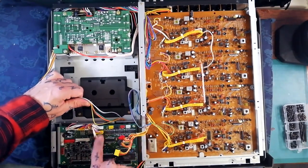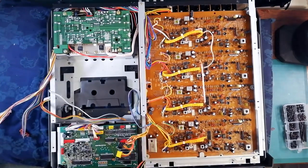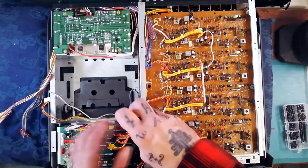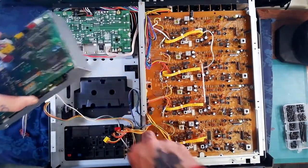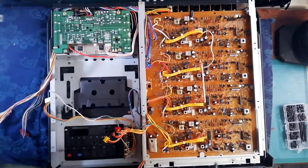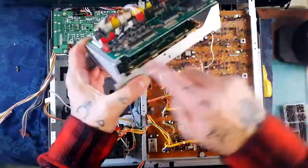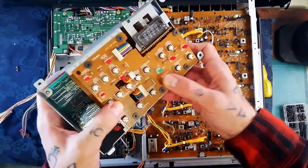These plugs here are connecting the two control boards and we don't need to detach them at this stage. The metal cassette is held by three screws, and at that fourth corner there's a little metal tab that goes into a slot — you can just see that at the bottom of the screen where I'm pointing with the screwdriver. This metal cassette actually includes three boards: Control B, Control A in the middle, and the shuttle controls with user feedback LEDs.